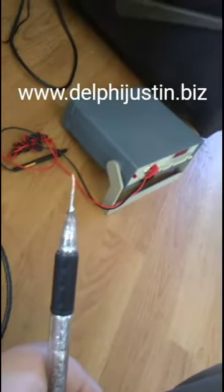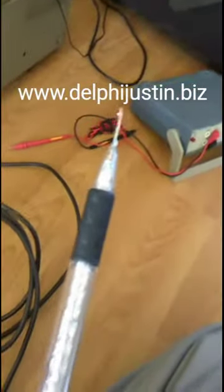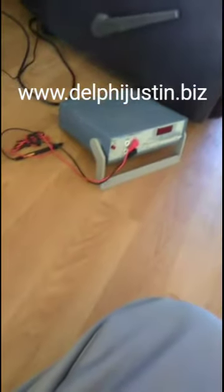Now, if you're making an oscilloscope for a sound card and stuff like that, a times one, well, of course, you'd put it through some division. But the thing is, sound cards, the impedances are not the same. They're made just to make sound go through it, practically. The impedances are different for each one. So probably put a voltage divider against a BNC connector and you have a times one probe like this one here. You would have success measuring signals.